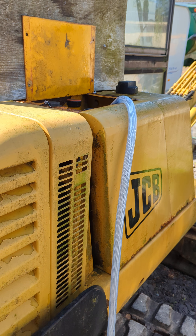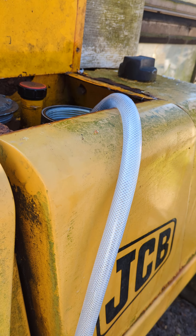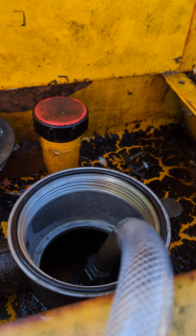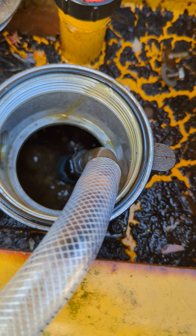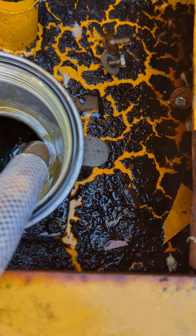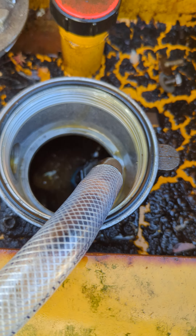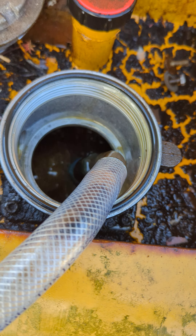What we have here is the JCB hydraulic oil tank — there was water in the hydraulic oil. So I opted to try one of the methods I'd seen on YouTube about blowing air through the oil. Rather than draining the whole system off, I thought the easiest thing to do is just take the filters out and drop an aerator in.